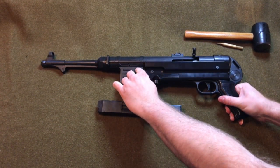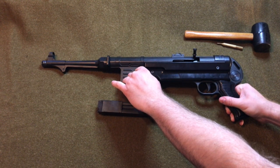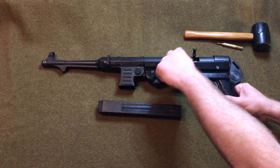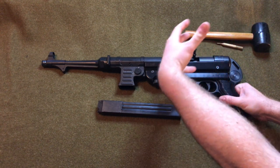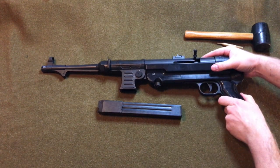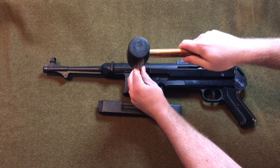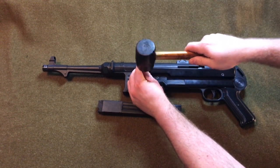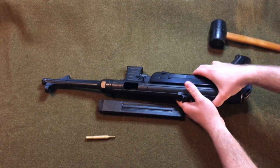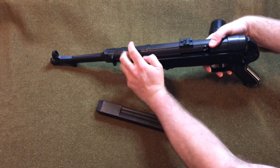We're going to go ahead and put the bolt in the safety catch up here, and then there is a small takedown pin on the side which separates the upper frame holding the barrel and the lower receiver together. There's also a massive spring right here alongside the frame, so I would just hold this in place or else the whole back part of the gun is going to fly out at you. I'll just go ahead and take a brass punch and give this a couple good punches, holding this back as tightly as I can.